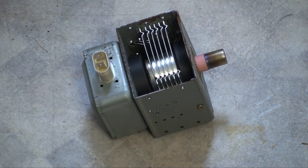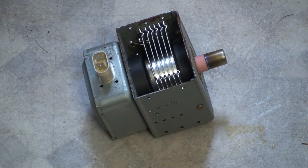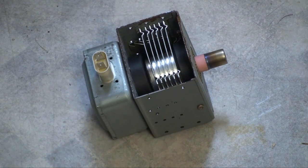And here we have a look at the magnetron out of the microwave. I did some reading on Wikipedia — it's quite an interesting construction. These magnetrons do have quite something in common with the good old electron tubes or valves. There is a vacuum inside of there. There is a filament inside of there — that's where these two connections are going. You have an anode and you have a cathode. The microwave oven transformer puts quite a bit of voltage in between the two, so we get some electrons flowing in there. Now, the big difference from a regular tube is that instead of just having some sort of a grid in there to control the amount of electrons from A to B, it has some resonators in there, and so it does create the microwaves.